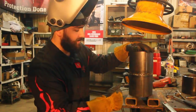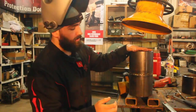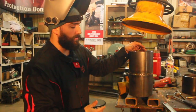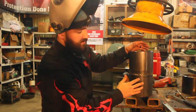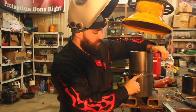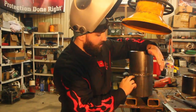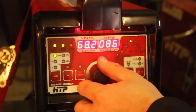If your heat is too cold or you're running too fast, the weld will roll and you'll trap slag on the top and the bottom. If you weld it too hot, it'll droop and roll over. So you want to find that perfect heat range depending on whether you're using a 3/32" or 1/8" rod. You want the weld to sit flush with the edges of the bevel — the bottom edge sitting close to the bottom of the bevel and the top edge sitting with the top edge of the bevel. You want to leave both edges visible so you have a reference point for your cap.